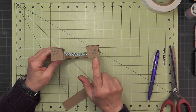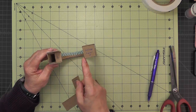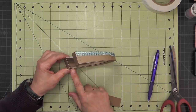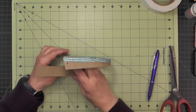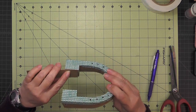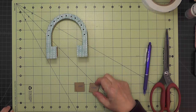I have these two pieces cut and they're just dry fit inside — I've marked them outside left with an up arrow, and on the inside I've put an L and an R to remember which side is left and right. This is an odd-shaped piece that goes in here — it's going to be about seven eighths of an inch tall and it's kind of slanted. Just hold it up in here and fit it inside, making tick marks so you can get that odd-shaped piece sized for each one. Once you have those four little pieces cut, set them aside in a safe place and we'll have them ready for later.